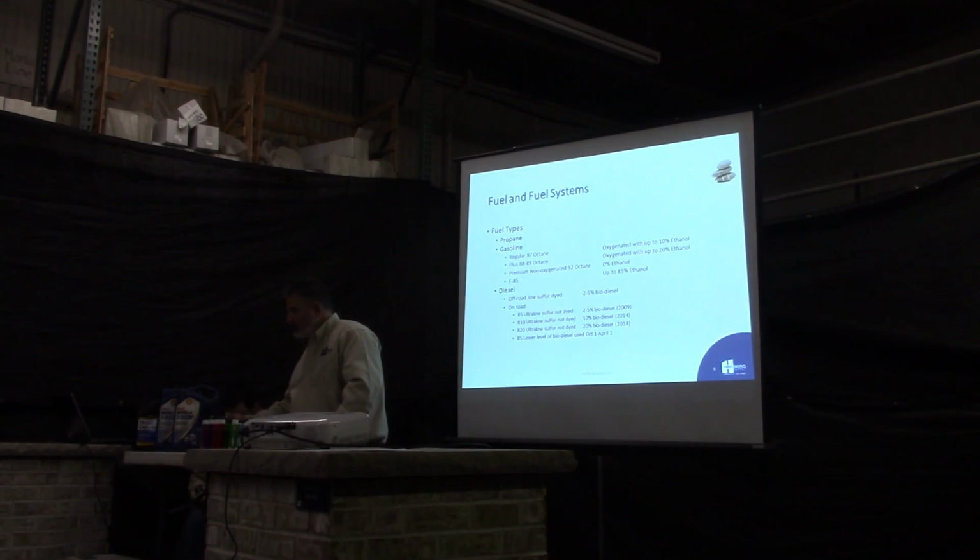I was always told to use that non-oxygenated in everything, so obviously that's kind of your choice. You can, but you really don't need to. I mean, the price of it's almost double. If you have a really old piece of equipment, let's say from 1970, that's not going to be set up to use the alcohol-based fuels. Everything newer, all the rubbers have been improved, all the seals inside have been designed to handle the alcohol without any problem. Of course, there's 20 people who will tell me I'm a liar, but everything we use that kind of fuel, we have no issues.